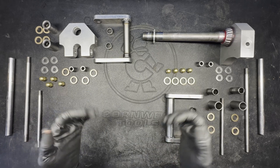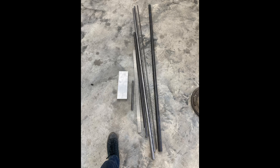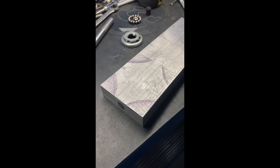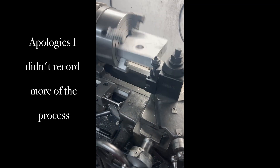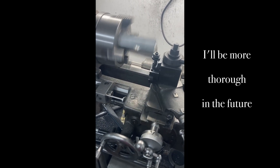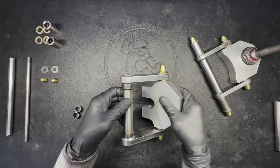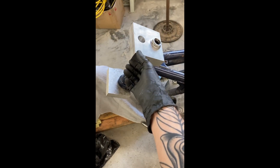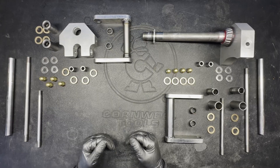I started off with this raw material that I ordered, and the first thing I made was the upper yoke. I made that with this block of aluminum, marked up the holes that I wanted, hacked it up, put it in my lathe, and here you can see me facing one side of it. The specs on this were really important for the tolerances I needed, so the end result is tight but operates smoothly. Once I got it blocked out like this, I was able to mock it up onto the bike and make sure my gap and distances were set right.